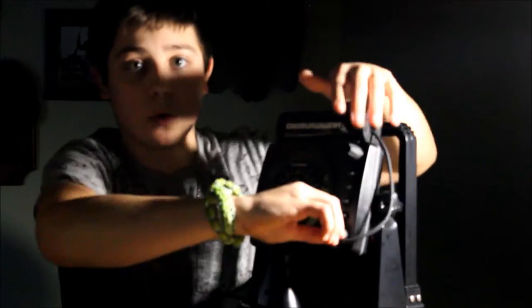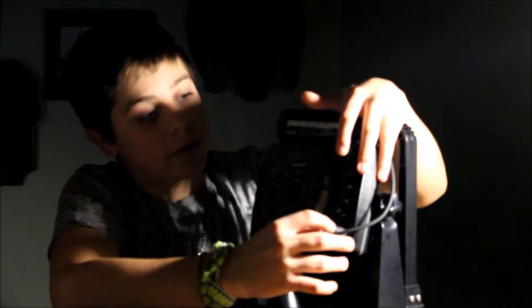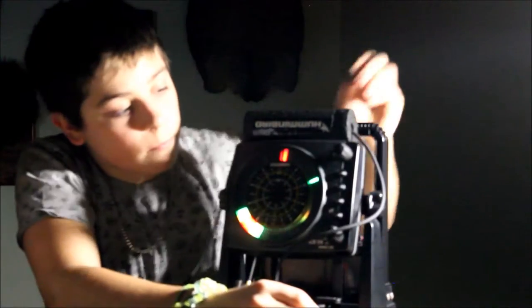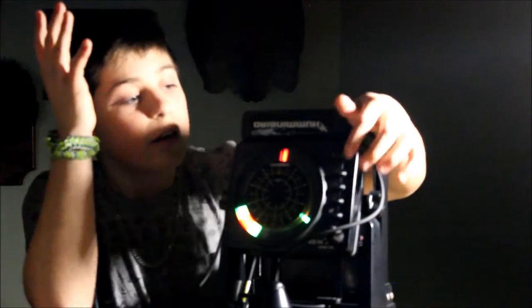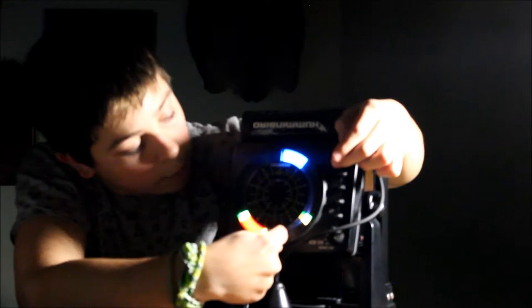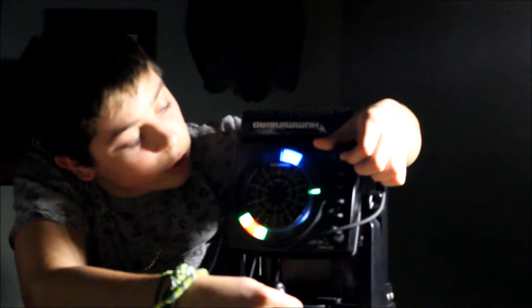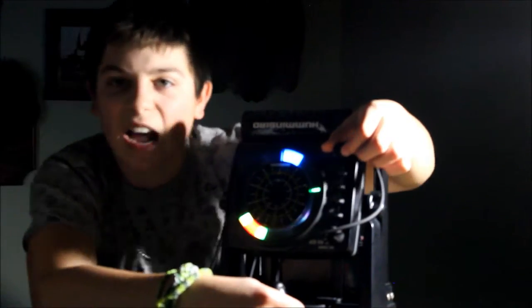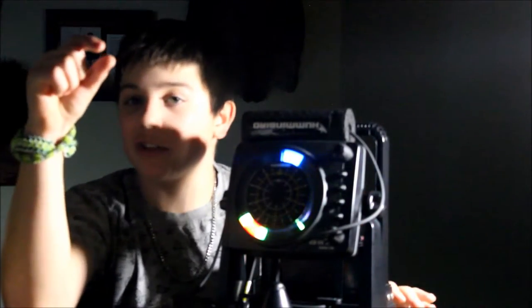Next we have the gain feature. Back in demo mode — the gain increases the width of the marks on the display. You don't even need to click the gain button; the dial is automatically set to gain if you just twist it. As I twist it up, the marks get bigger and more clear. Twisted down, they get smaller. I have it set so I can see even a tiny little Tungsten jig. If I'm using a bigger jigging spoon I'll lessen the gain.